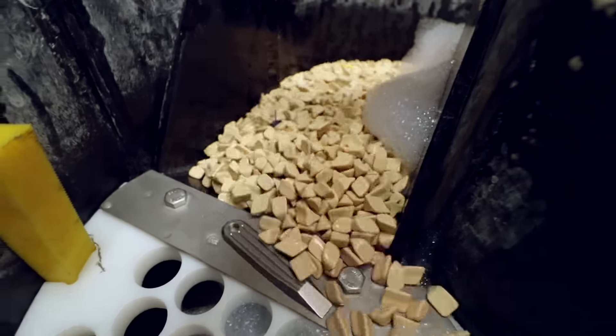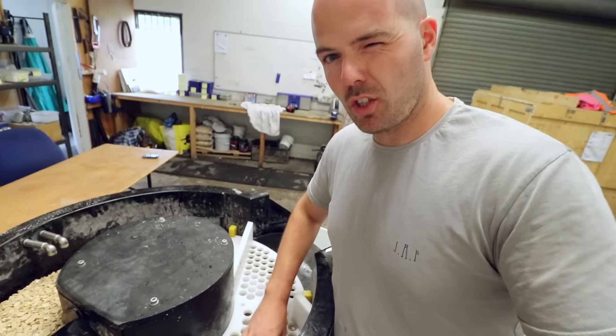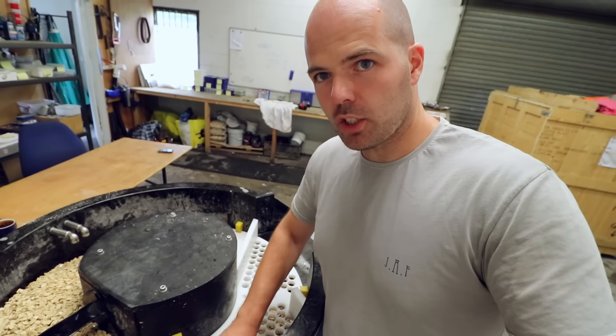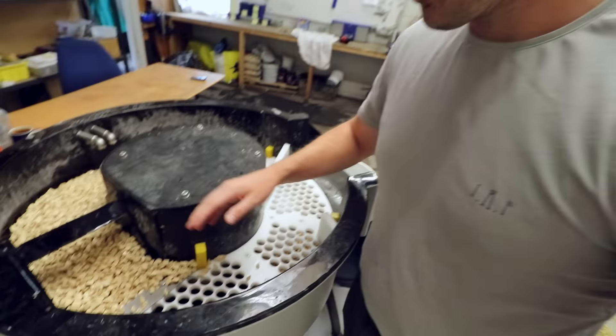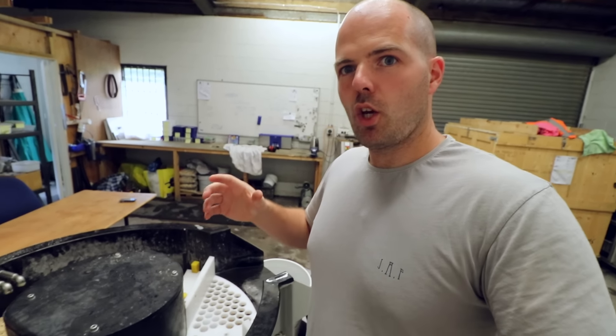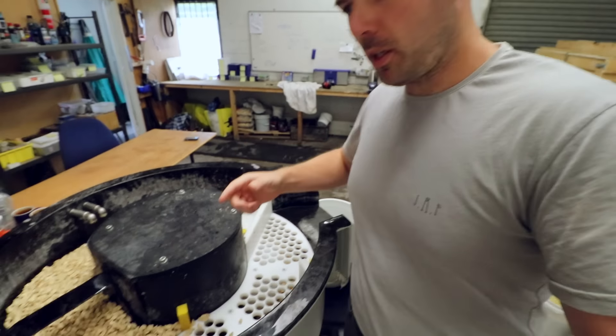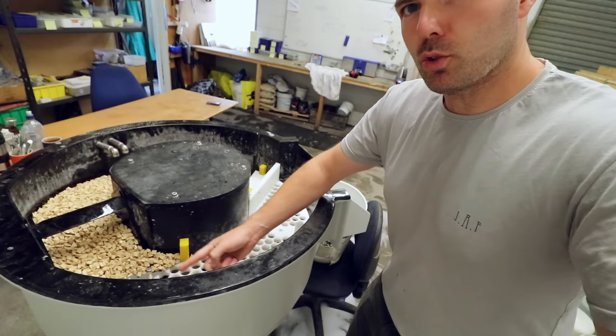What I just showed you was the way it gets emptied. We put in this plastic — I think it's called PTFE plastic, quite soft stuff — and all the media falls down. There's a little ramp we put up here, and because this donut-shaped bowl has a particular rotation — it's got two types of movement — one causes the media to go around inside and the other causes it to go in the other direction. So basically the media spirals round and round, and when you put this ramp in it all bunches up and starts pouring out.